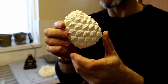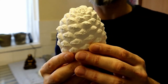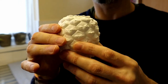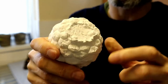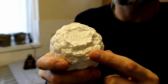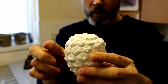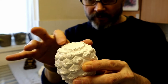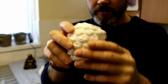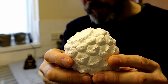We've got a pinecone here which has been featured in a few recent videos. The main cast has turned out great — very crisp, perfect cast on the top. If I turn it upside down you'll see a few holes around the base, around the underneath of the pinecone. The reason the air got trapped here is because the mold envelopes that part of the cast, so you need some extra shaking and tapping to get the air out.